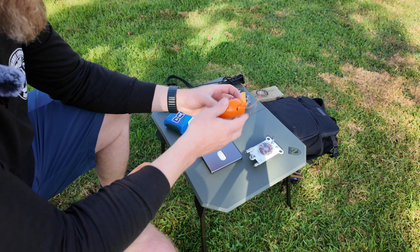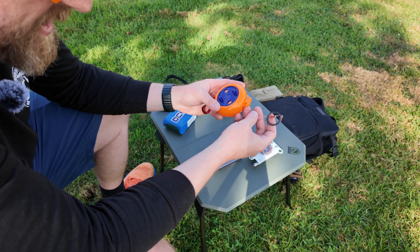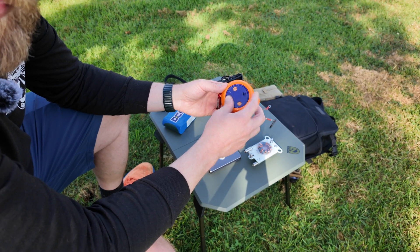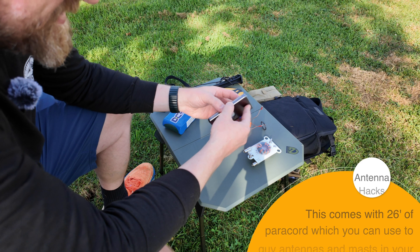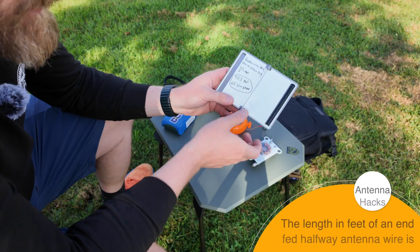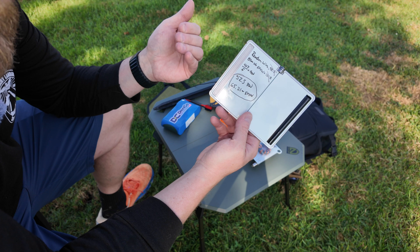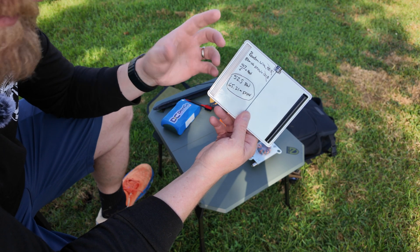What I did in parallel was I took a bunch of braided — I don't know if this is copper clad or fully copper — fishing line. It's pretty strong stuff. I got it off Amazon, it's really cheap, and I threw it on a clothesline winder for camping. There's like 120 feet on here, which is way too much. I did some quick math and also went to a website — I'll post the link in the video description. If you're going to run a random wire and you want relatively okay capability on 80 meters, which is going to be the lowest band we want to operate on, we're going to aim for about 52.5 feet of cable or wire.